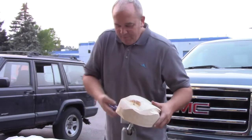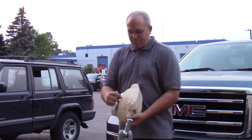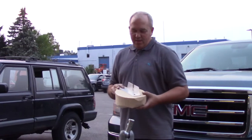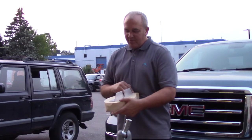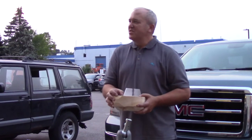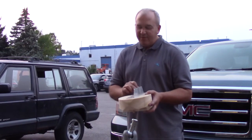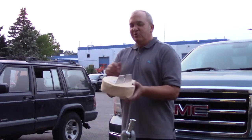One other thing, when I bandsawed out this body, I've got a bottom board on here, so I cut that out with the body. Then when I'm setting it up, I'll draw a center line down the middle of the body. And then I'll measure in about 2 inches, 2 1/4. There's no right or wrong on that. But I'll go about 2 1/4, 2.5 inches from the front, and the same from the back.